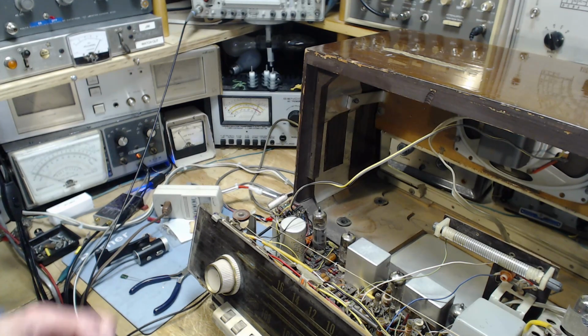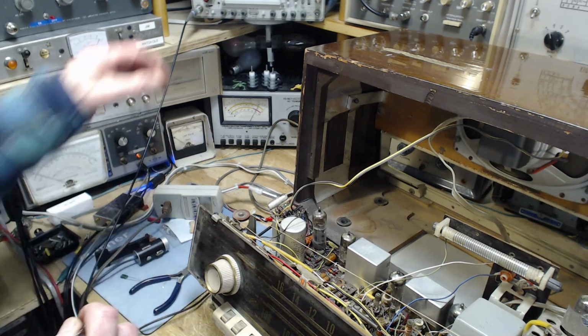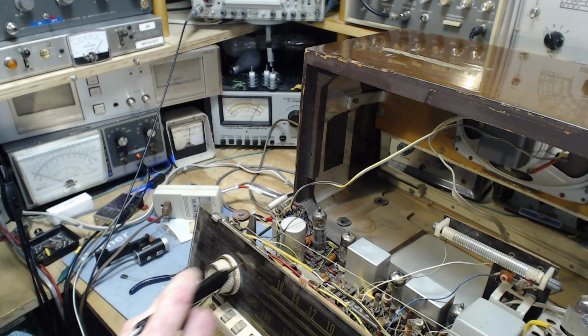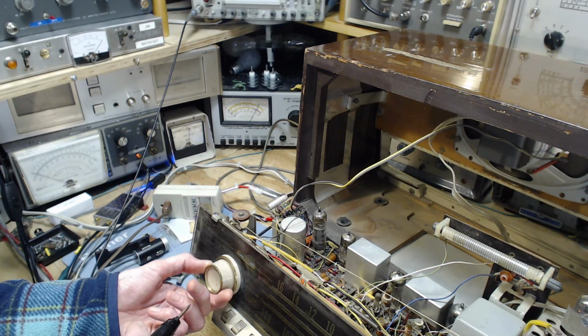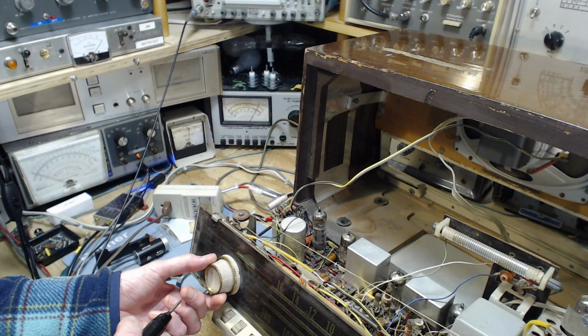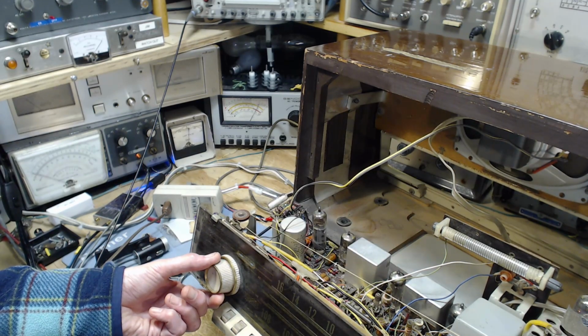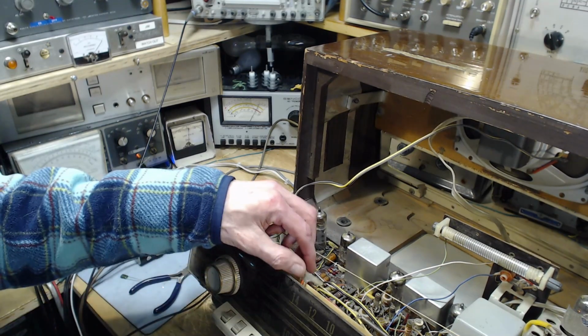Unlike other filter capacitors, especially those cardboard ones you get in the cheap table radios, they're almost always shot. The magic eye is on, which suggests there's B+. Okay, we're going to give it the full Monty. I didn't give it full voltage yesterday, so maybe it didn't work because of that. I hear it. Did I hear it yesterday? Okay, B plus. Kind of dragging the pointer around. B plus, broadcast band.